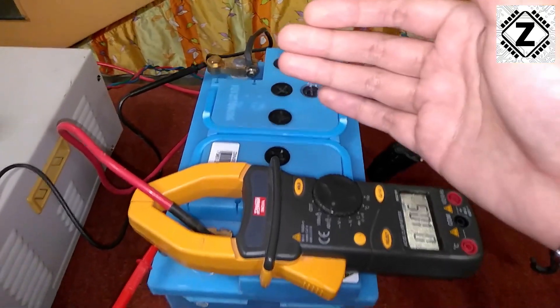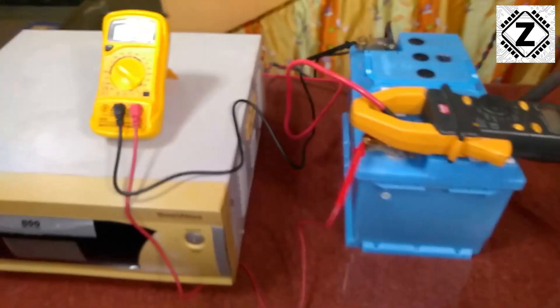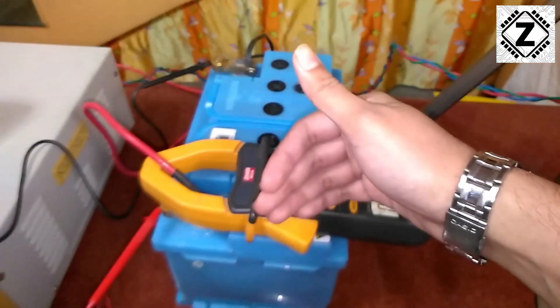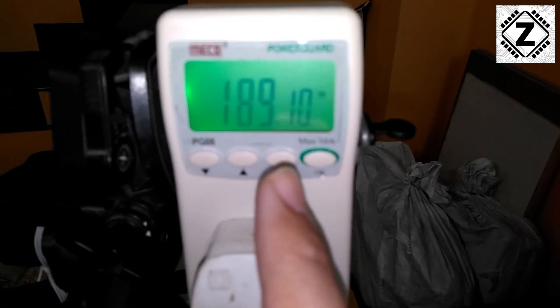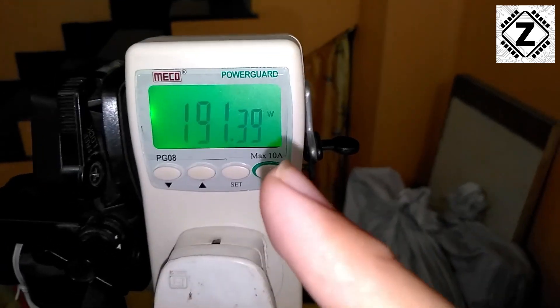After some time we'll come back to see how the charging amperes slow down as the battery approaches its float voltage at the end of the charging cycle. Currently: 12.8V on the voltmeter, 10 amperes on the clamp meter, and 190 watts coming from the grid. Let me be clear — this is not just coming from the grid, it's coming from your pocket, because you will pay for this 190–200 watts in your monthly utility bills.